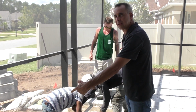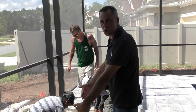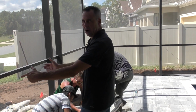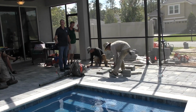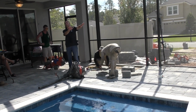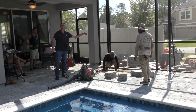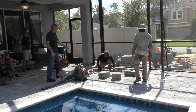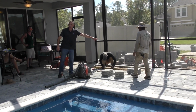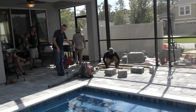They'll come in 10 inches. They'll bring this out here so it's a 30-inch cutout and have another return ledge so they can drop the grill in. So right now they got to grade this out at this end because the pool deck always pitches back to the deck-a-drain. You're higher at that end than you are at this end. So what they got to do is actually remove grade at this end so the retaining wall is built level starting at your lowest point.